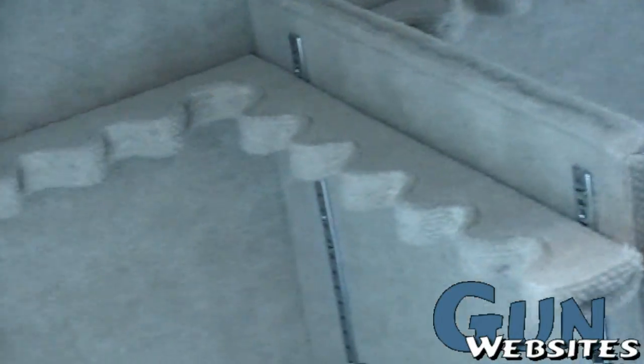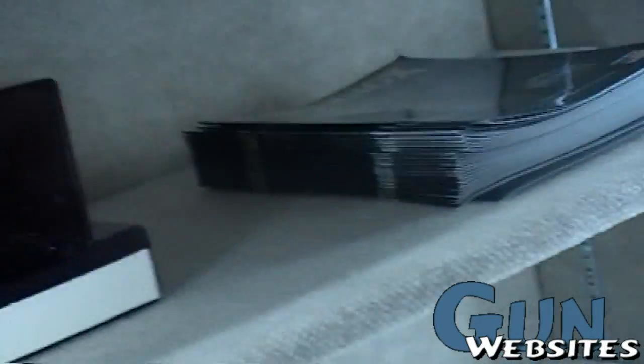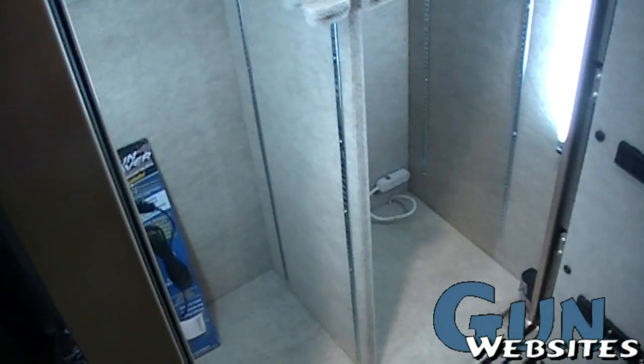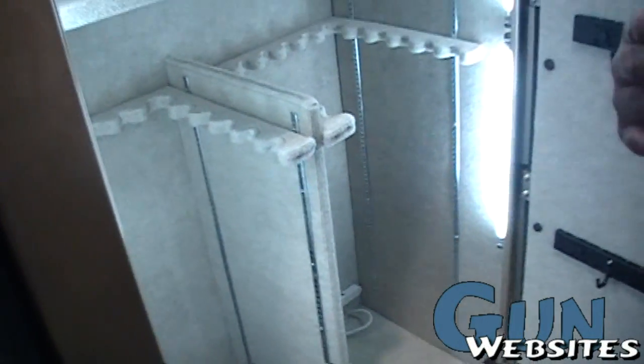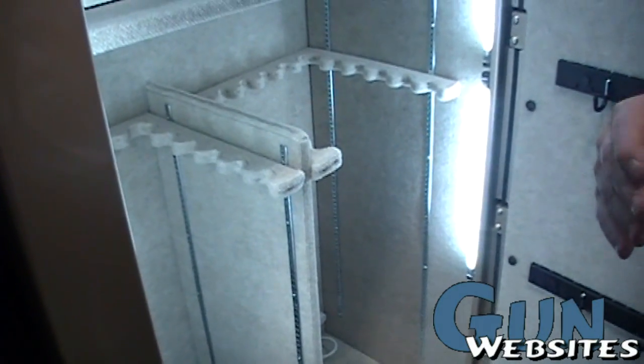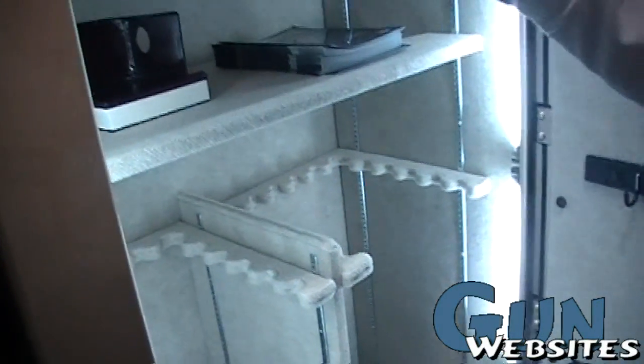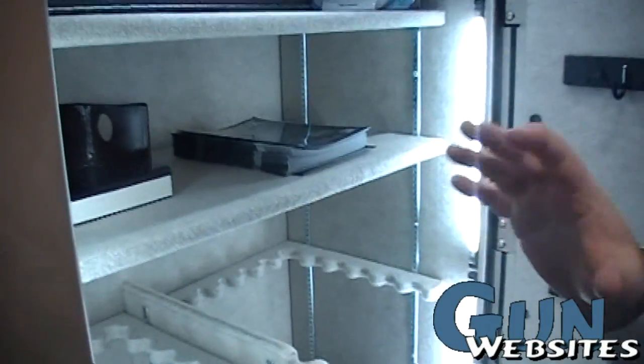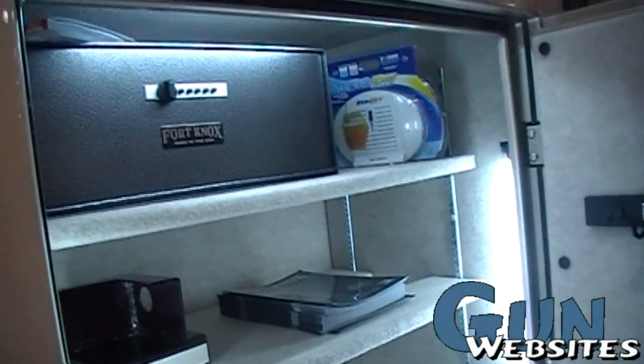The question a lot of people ask is, how does that react with fire? In a fire setting, you've got to have a draw and a release, just like your fireplaces. With the door sealing shut, there's no release. So there's not going to be any draw, fire-wise or heat-wise, out of that hole that the electrical comes into.